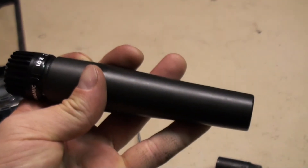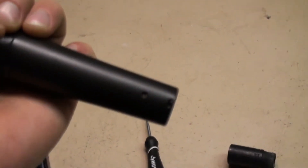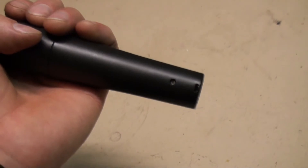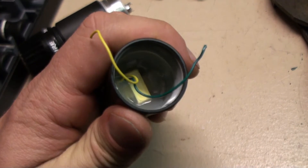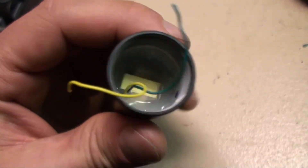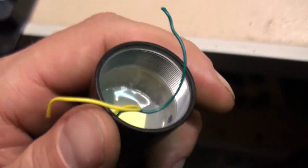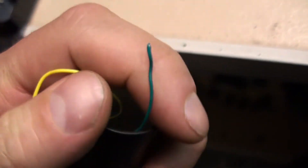I'm going to tear into this to see if there's anything obvious that can be fixed. I'll check the XLR input first and see if there are any broken wires there. Got the mic apart — just decided to cut these wires, I'll solder them back. Check the schematic: there's actually a transformer down there in the glue goop, which I imagine is for impedance matching.